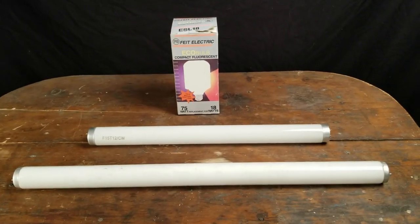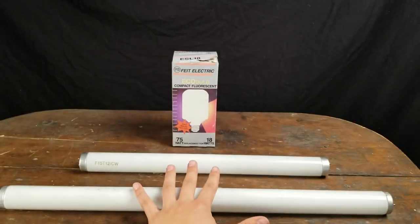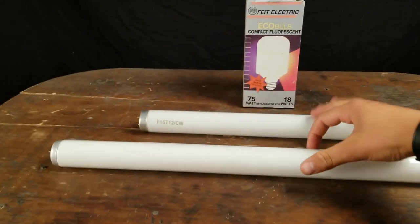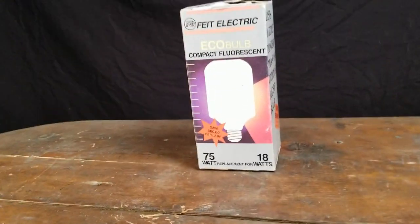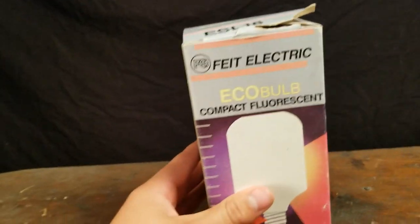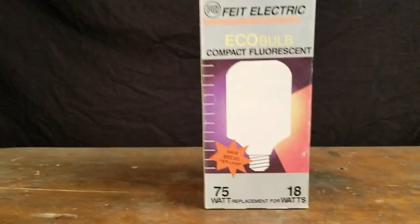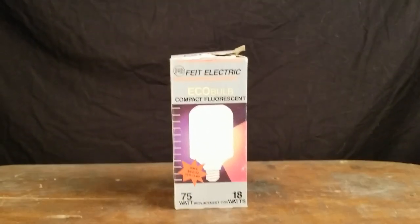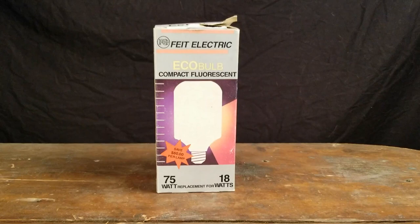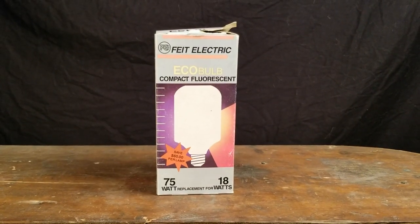The problem is their size — 15 and 18 watt fluorescent tubes respectively. And you can see here, compared to my hand, they're really, really large. And this was a problem because a couple people got creative and would bend them into U's or D's even, but they were just large and flat. So they were relegated largely to kitchens, bathrooms, and office spaces. They were well-suited to office spaces because of the long periods of time those are on and the low-quality light required for office work.